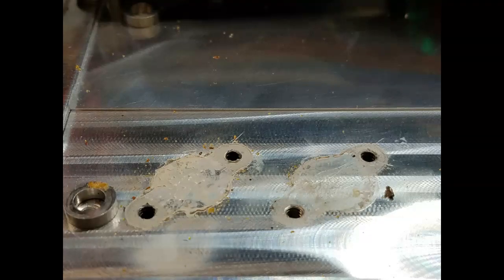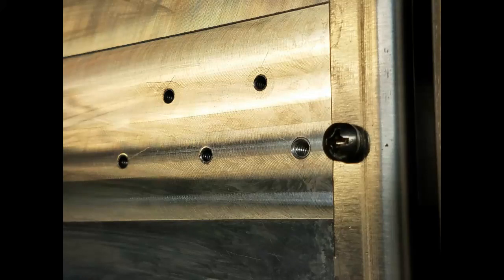This is what a heat sink looks like after it's been washed down and all dirt removed. You can see little impressions where the transistor was tightened down, and you can see all the little milling grooves and swirls still in the heat sink. We've got to get rid of all these swirls before we bolt the transistors back down, or we still won't have very good thermal conductivity between the FET and the heat sink.